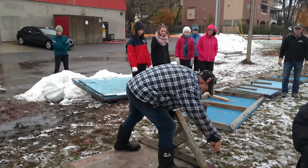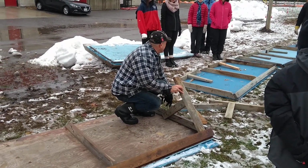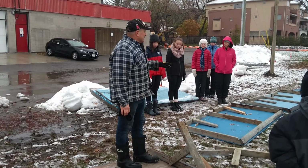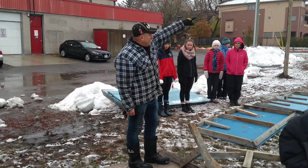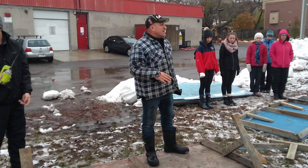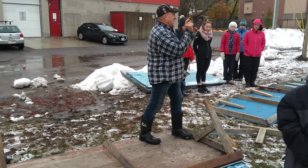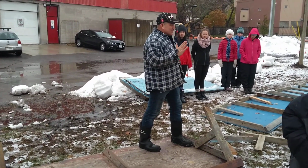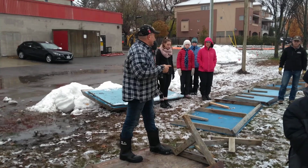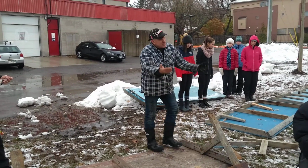And then we need two screws up here and two screws from the inside, not the outside, because once the boards are all set up, we can't access those screws. And if we need to change any pieces, so screws from the inside. That's why we ask for all those cordless drills. There are screws over on the table by the red shack. Yeah, for these we need the 3 inches or 2.5, okay? And make sure you don't drive those screws in like 1.5 inches deep because it makes it really hard in the spring to take out. So just flush against the wood and try to be straight in and not at an angle because that also makes it hard in the spring to take apart, okay? So pushing straight in, 2 screws here, 2 screws from the top, and then the boards get flipped up.